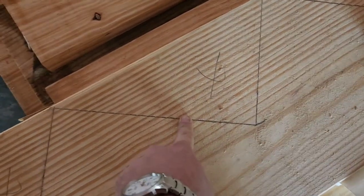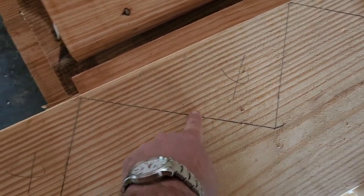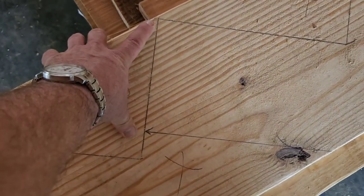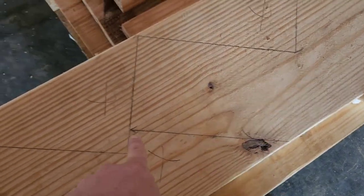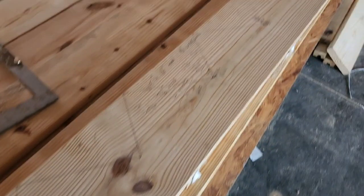My first step needs to be 6-and-a-sixteenth inches. This is step number 14. I marked it out one more to give me the 90-degree line, then I measured down for my first step — which is 6-and-a-sixteenth off the floor — and make another 90-degree mark there. Then all this gets cut away everywhere I have an X. That gives me my stringer, and then we'll just use this as a template to make the other two.